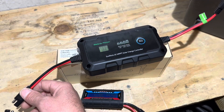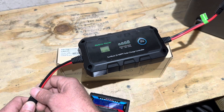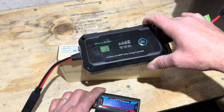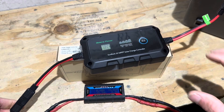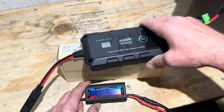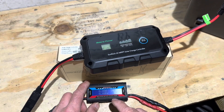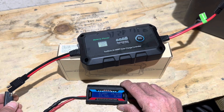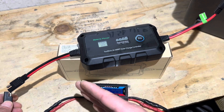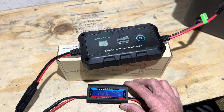I'll bring it back down around 40 volts to find the exact voltage that triggers the E10 error. At 40 volts: E10 again. Bumping down a little more — E10 again at 38 volts. Down around 35 now, that's about where it was before. So it looks like the true hard limit is 35 volts — it has a little extra VOC headroom beyond the rated 30 volts for cold weather and similar conditions. Their stated limit was 30, but the actual true limit appears to be 35 volts.